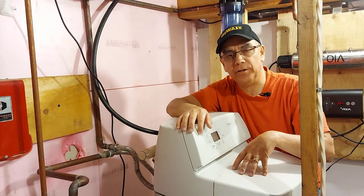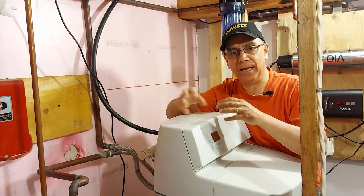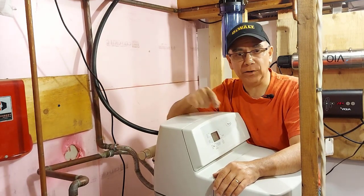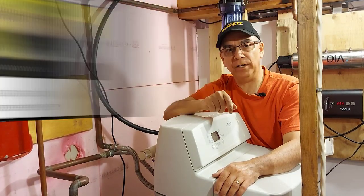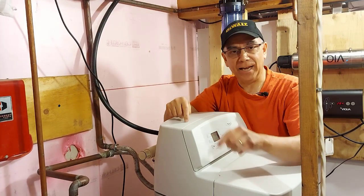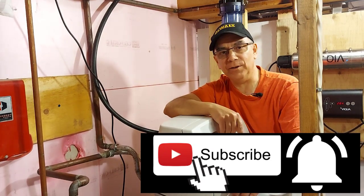So again, if you're finding there's more water in your water softener tank than there should be, that could be the issue — the venturi. Take it apart, clean it with soapy water, put it back together, hook it back up. Then you can do a recharge to try it and make sure it's okay. Mine is okay — I just wanted to show you how it's done, so I'm not going to do the recharge. At the end of this video there'll be a link to another video I did where I did the full diagnosis on what was making the water sit inside my tank — I found out it was the gasket inside the venturi. Thanks for watching, don't forget to subscribe, and we'll see you on the next video.